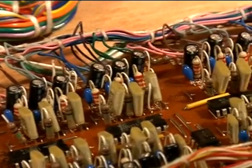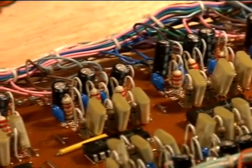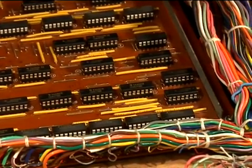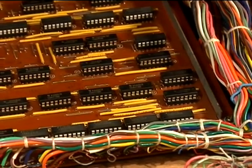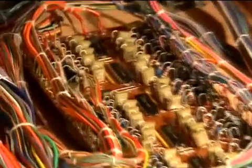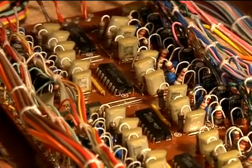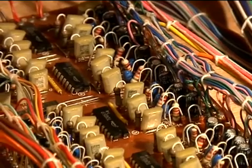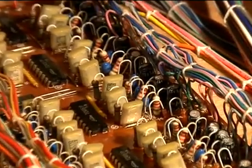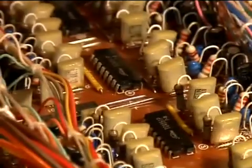That means there are 61 banks of little capacitors and resistors. The 4051s decode the proper inputs and select the proper pressed key, as instructed by a 3-bit instruction code generated by the TKC logic. The multiplexed aftertouch voltages exiting the TSB1 and TSB2 boards enter the TKC board for further decoding. Like the TKC board, the 4051 ICs are susceptible to age-related failures, so these will all be replaced. I am also going to be replacing the tantalum capacitors with polystyrene and the mylar with polypropylene. The electrolytics will all be replaced with brand new Panasonic EV series, just to ensure long-term reliability of a very critical part of the keyboard's functionality.